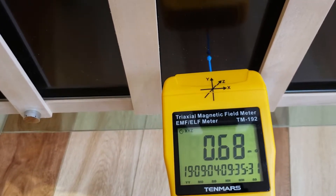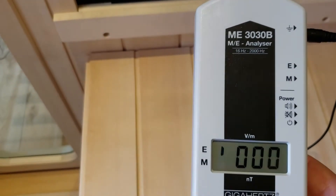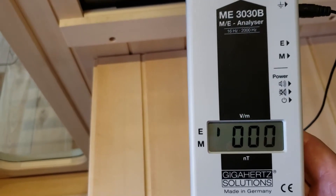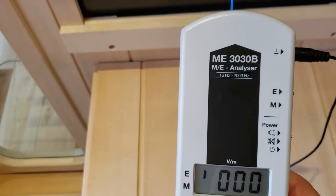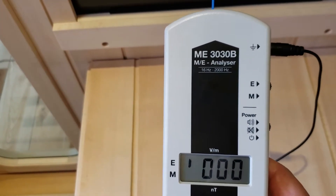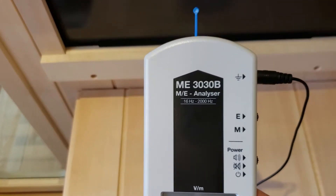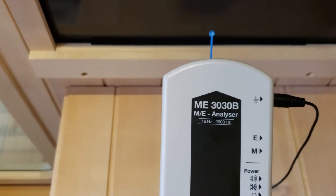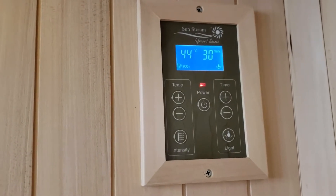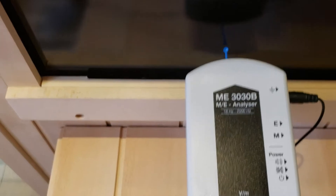Very low EMF magnetic field readings. I'm going to switch over to the electric field meter. Today I'm using our Gigahertz Solutions electric field meter — made in Germany. A couple of quick notes: according to the manual, to get the most consistent and reliable results you want the meter grounded, so this wire is running from the meter out to a wall receptacle connected to the building's ground system. Our one-inch probe is mounted on the front. All heaters are on — 44 degrees Celsius inside the sauna.